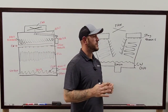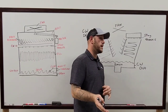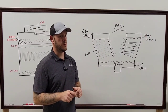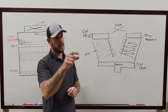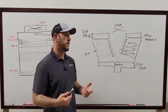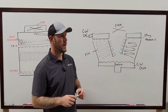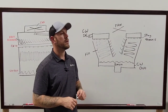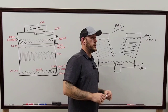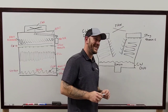And the vibration switches are weird too, because there's certain manufacturers that go off of different settings. So a lot of the time you'll just have to read the book as to what they want. Most of the time what I do, I can't remember what the actual measurement is, but 0.4 is the setting that I always set it to, which is more in the middle section. More like with that iPad that we read the vibration readings off of, which would put you right at about 1.0 IPS, which would be right in the yellow, you know what I mean? Mm-hmm. Just tripping the tower enough to say, hey, we have something going on, somebody needs to check it out. But you also don't want to set it to where the damn thing has to fall over in order to trip either. It depends.